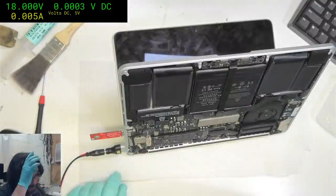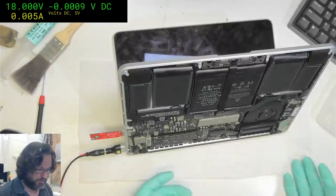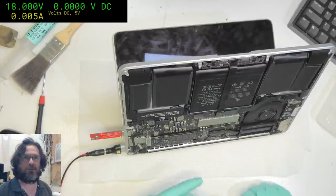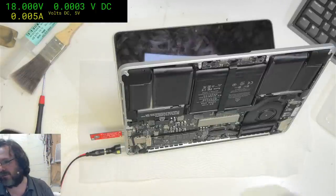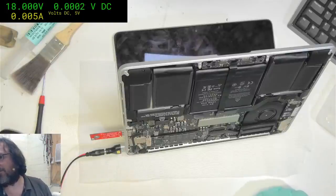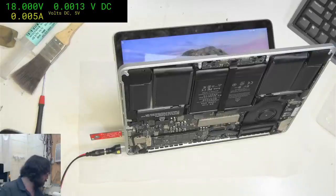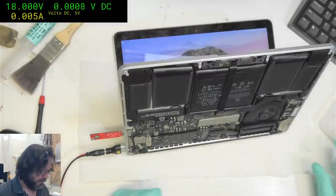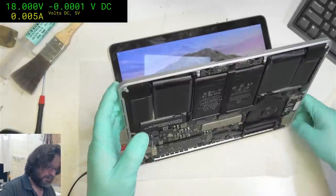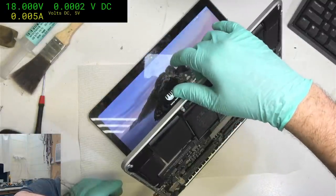You are booting. Alright, okay, so what we can hope for in this scenario, since all of a sudden it's working, since it's been shipped, is that we've got a bit of corrosion on the backside somewhere. Better to clean circuit boards: acetone, non-acetone? Oh, never acetone. It depends what you're trying to clean up. If it's anything that's water-based, like cereal, or anything potentially soluble in water, use something like 80-20%. So 80% IPA, 20% water. Stuff like that. And then when you've come to clean the flux, that's when you use 100% IPA.